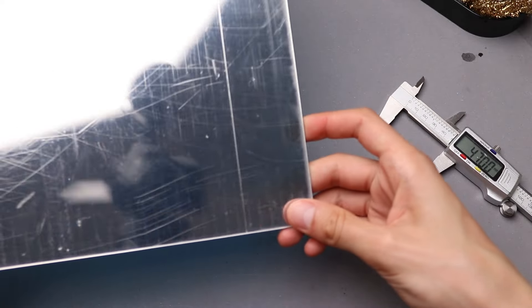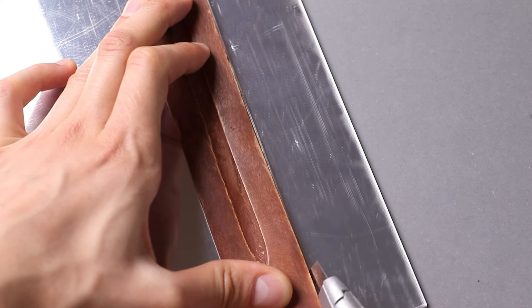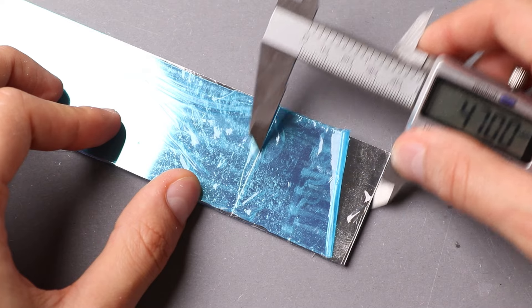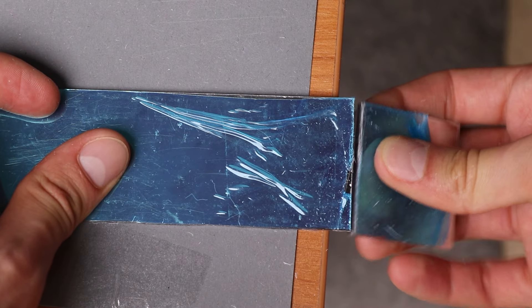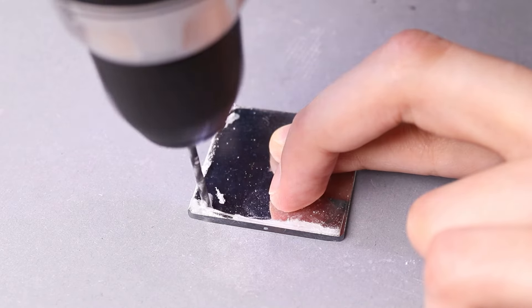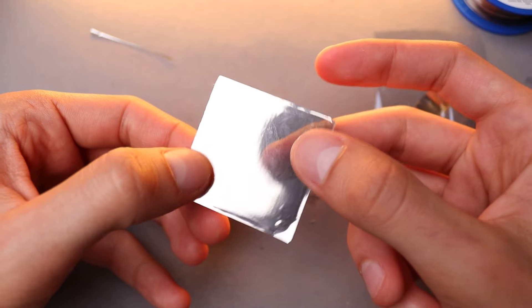Just to be sure, I also tried a third design. I simply bought a two-way mirror from AliExpress, which is also made from acrylic. Unfortunately, it was a little too big for the badge, so I had to cut it myself. And if, like me, you don't have tools at home, it can be a little problematic. However, here is a life-hack: just scratch the acrylic sheet with a knife several times and bend it until it snaps. It is also better to cut it from two sides. Then I polished it a little, drilled holes, and here is the result. I believe the AliExpress mirror gives the best look, but making a mirror with a film by myself was much easier because no acrylic cutting was needed, and it was much cheaper.